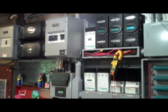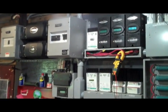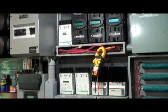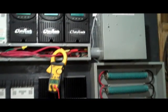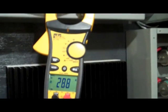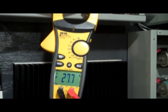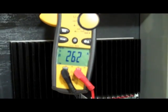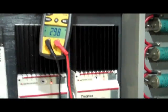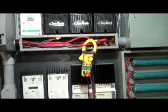We're running some more fuel consumption tests on the Lister engine today. Here you can see the charge controllers set up. We run our axial flux alternator into an MX-60 — we need to do power point tracking on the alternator. We're getting the engine up to temperature. We're drawing approximately a 1500-watt load, slightly under. Measuring the current out of the controller against what the controller is telling me on the screen — we see about 29 amps on the screen and about 29 amps on the controller. A little shaky, but it's close. We want to make sure we keep the load consistent throughout the period we're measuring so we don't get any discrepancies in our calculations.